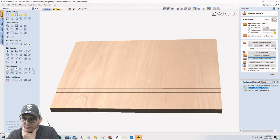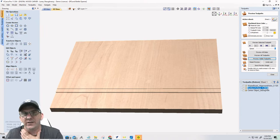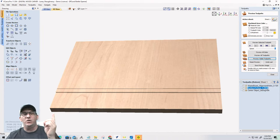What is the difference from normal surfacing? This is normal surfacing. There is no difference, but I've seen people surfacing their wasteboards or anything, and they've got a rectangle and they do a pocket cut. And it's going back and forth, back and forth, back and forth. I cringe when I see that, because we're going conventional, climb, conventional, climb. And every time on that climb cut, the bit is burning, building up heat and everything.